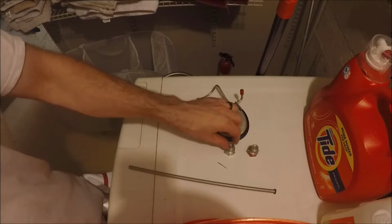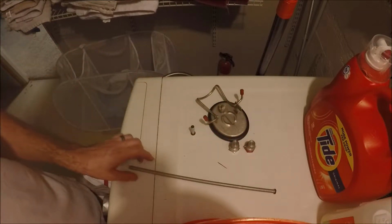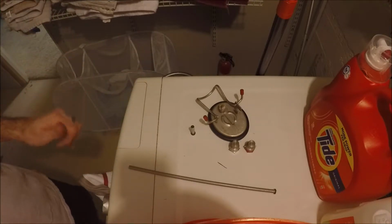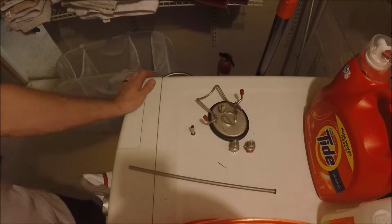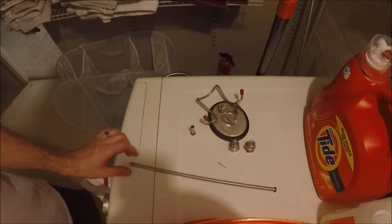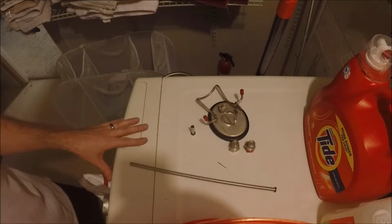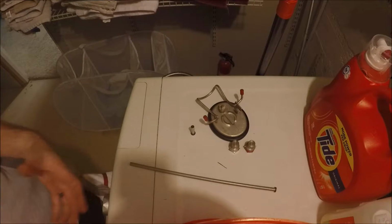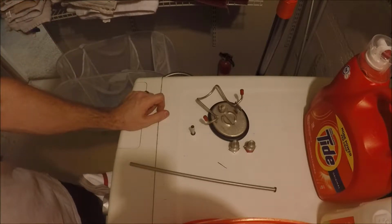But that being said, when you pop open these kegs, the first thing you'll notice is the kegs are really, really dirty. They've been sitting in a warehouse for maybe 15 or 20 years because using these corny kegs for soda went out of style in the 90s. So you've got some syrup that's been sitting all over in the interior of the equipment. It's been maybe hot, so it's been drying out, and it becomes a really nice glue on some of these parts when you get the keg.